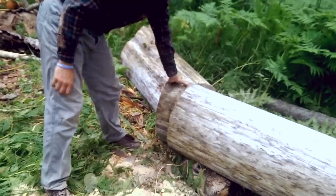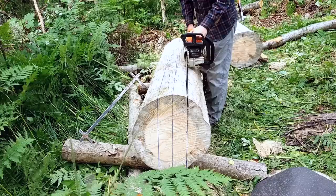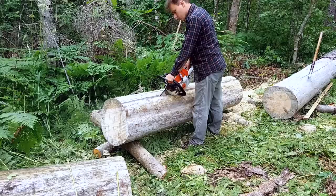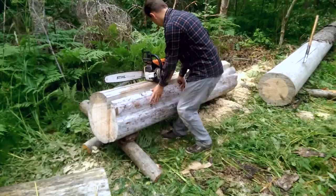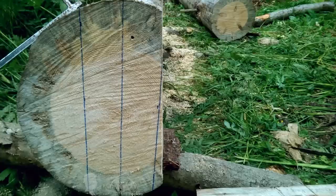Naturally dried northern pine is called kelo in Finnish because it is considered to be valuable. In natural circumstances, very old pine trees usually die while standing and then slowly dry for years. Kelo logs and slabs are fairly dense and don't crack as they lose wood stresses during natural drying processes over the years while standing vertically. The core of the kelo is light, while the sapwood is colored gray by fungus that lived there during the drying process.